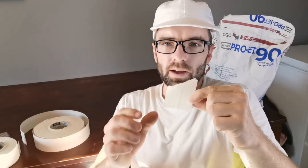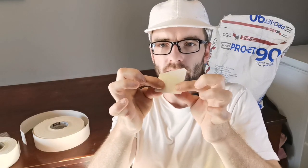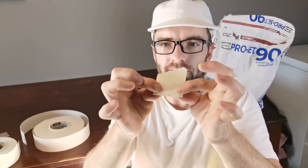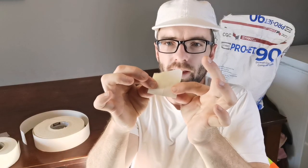The reason why paper tape is so much stronger than mesh tape at preventing cracks is because it's very rigid — you can't pull it in any direction. When cracks happen, it's from being tugged from the side when stress on a building causes drywall sheets to try to separate and pull on the drywall tape.